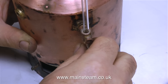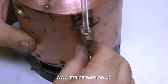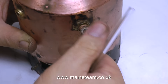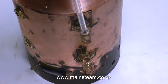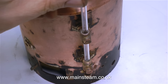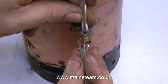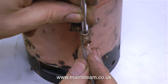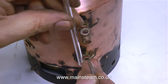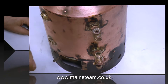The first thing you have to do — and you must get this right — you need to align the two parts of the water gauge fitting so that the glass fits accurately. If the fittings are not aligned and the glass is crooked, when you tighten up the nuts you're more than likely going to crack the glass. And if you don't crack it at that time, the gauge glass will probably crack when the boiler is in steam. Getting a face full of broken glass, followed by water, followed by scalding steam, is not really my idea of a fun day out.